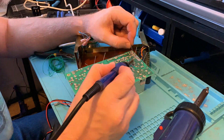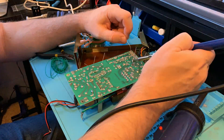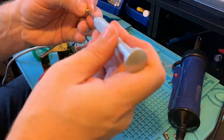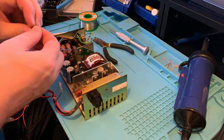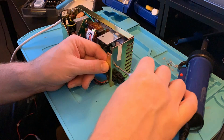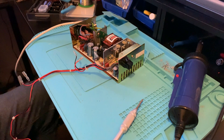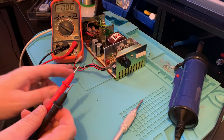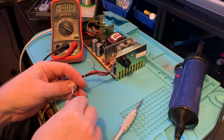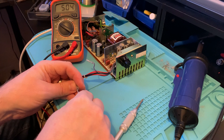With those lifted pads rerouted, we'll pop round and solder in all the other new capacitors, reflow some old and cold joints, and pop the unit back together again before we test, to ensure we don't have any shorts or issues as a result of putting the board back. Time to plug it in and check the voltages. We're looking for a steady 5V which is distributed across the BBC Micro mainboard, and according to the service manual this was to reduce the need for thick tracks on the board to distribute power. Clever. And we've got a nice solid 5V.